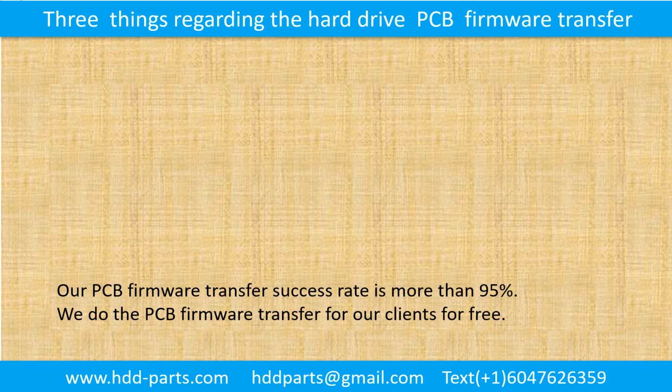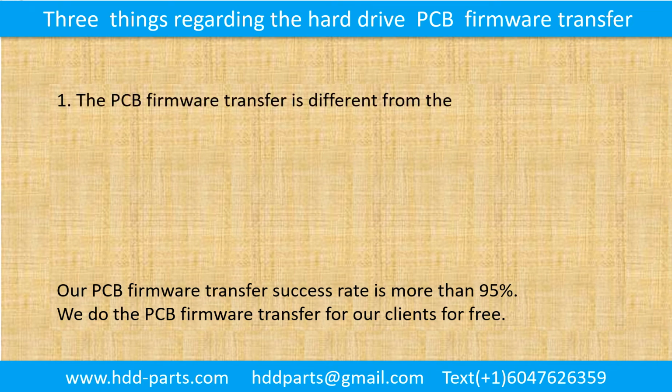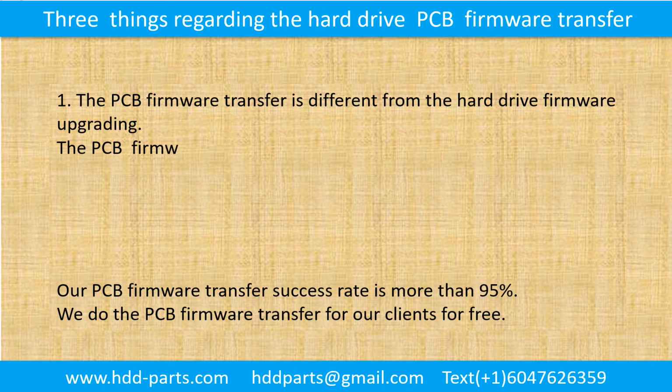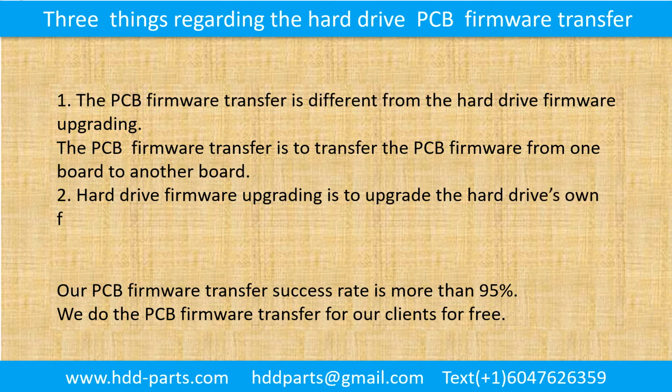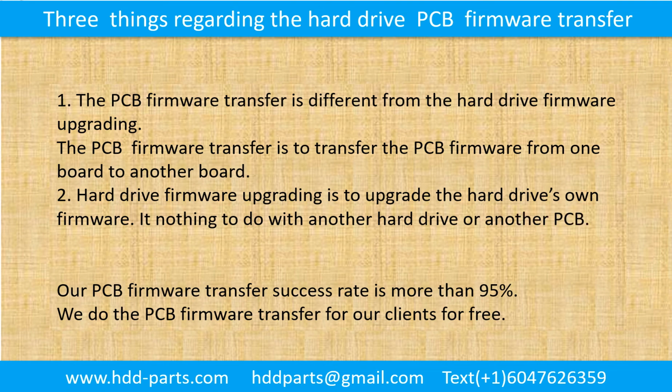We call this hard drive printed circuit board firmware transfer. 3 things regarding the hard drive printed circuit board firmware transfer. 1. The printed circuit board firmware transfer is different from the hard drive firmware upgrading. The printed circuit board firmware transfer is to transfer the printed circuit board firmware from one board to another board. 2. Hard drive firmware upgrading is to upgrade the hard drive's own firmware. It has nothing to do with another hard drive or another printed circuit board.